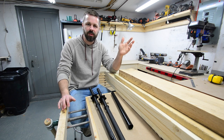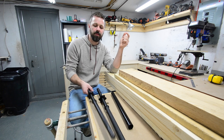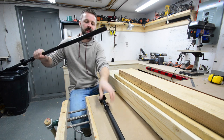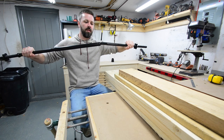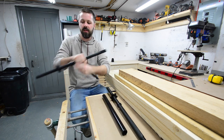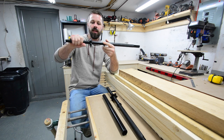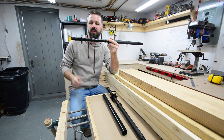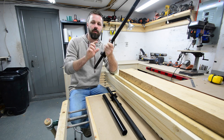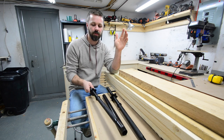There are a few options out there. I've seen staging jacks being used, but what I thought of was these dumbbell sets. This is like a three-piece set — it comes with a barbell, but I don't need the center portion. What I'm interested in is this Acme thread. This is actually a one-inch solid rod and it's got a really nice loose-fitting Acme thread, so it spins nice and fast. It comes with the nut as well as the bar, and it was $45 brand new.